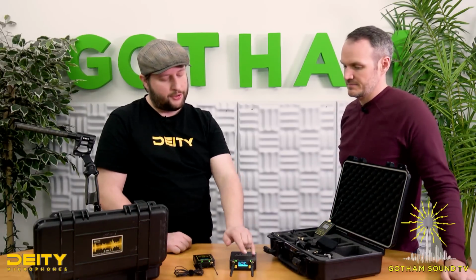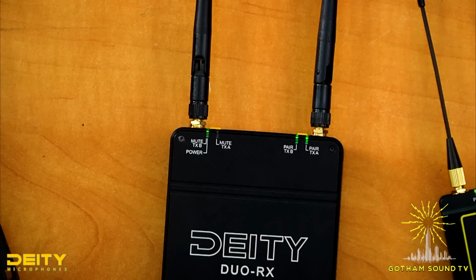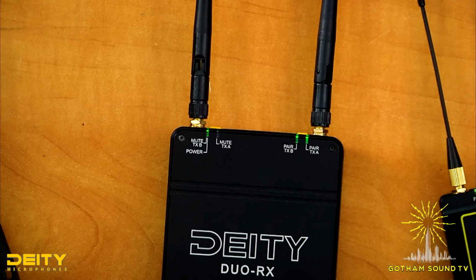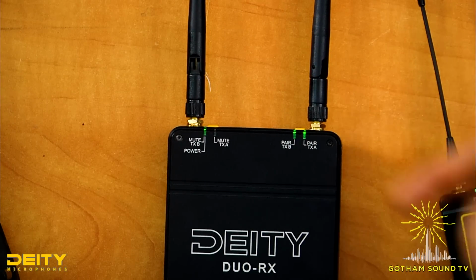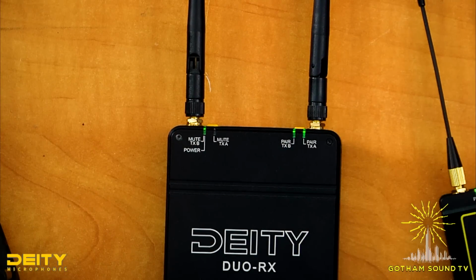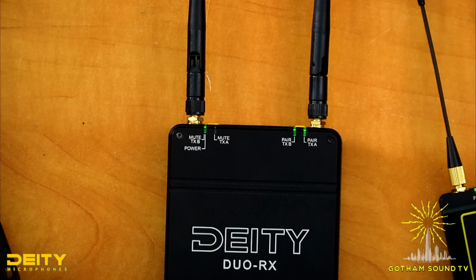Oh, wow. So it is actual diversity per receiver. So per receiver. 4 receivers in there. Yeah, so there's technically 2 receivers per chip. And if you had a nice Yagi antenna, you could actually go into both of these with a passive splitter. And technically you are targeting multiple chips for the multiple receivers, or the multiple transmitters. Wow, awesome. Joe, what else you got?